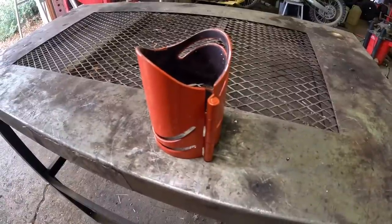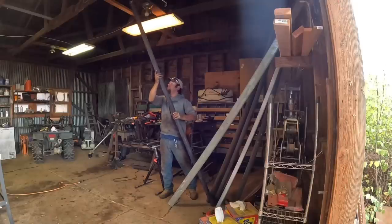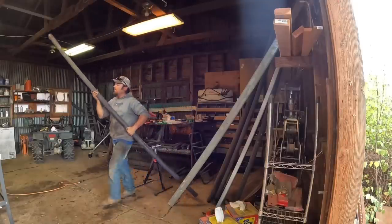Up these cutting guides, and these are going to enable me to cut a nice notch in this pipe so that it all fits up together and welds together really nice. I will show you how these notchers work, and I'll show you how I get everything aligned, because I think that's the hardest part, is just making sure that your notches are both clocked the same on the pipe so that when you fit it up in that square, everything fits.